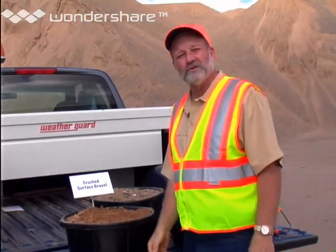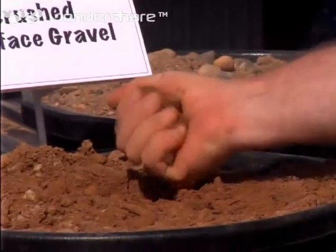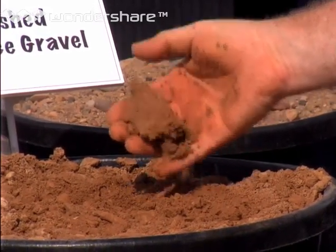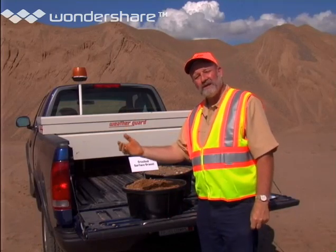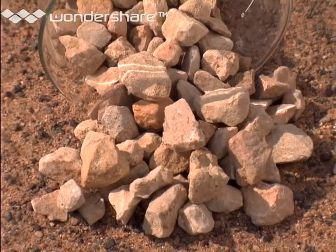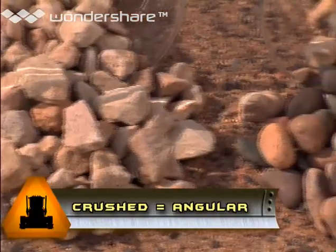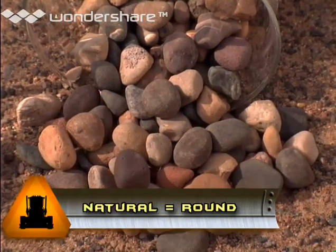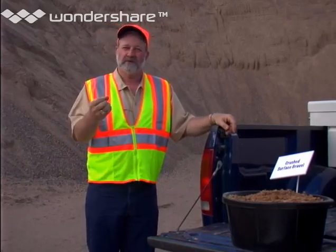The third component of good surface gravel is 8 to 15% fines. Fines are the glue that keep the road surface bound together — they also keep the gravel from blowing away, washing away, or being dislodged and thrown by vehicles. Plasticity is a technical term for something that good surface gravel has and other gravels don't. Plasticity means that the material sticks together and resists falling apart. There's an old field test in which you simply made a ball out of it — if it remains bound, it's clay; if it doesn't, the fines are silt. But if there's any doubt, you must have it tested. It's almost impossible to find good natural surface gravel occurring naturally in the gravel bank — called pit run — so it should be processed by crushing. Crushing fractures a portion of the stone, giving it sharp edges which allow those pieces to interlock or wedge together in the fines. Natural rounded stones will dislodge much easier under traffic. Fresh good gravel helps you avoid washboarding, reduces material that builds up along the shoulder, and reduces overall maintenance costs.